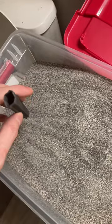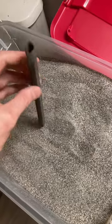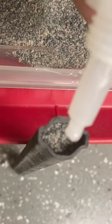Alright, so today I'm going to show you how to reduce vibrations on any 3D printer, but particularly the Ender-3. So you're going to want to print these out, get you some sand, fill them up, tap them down, glue the top on.